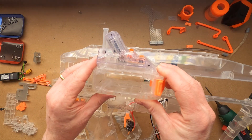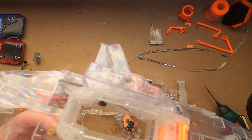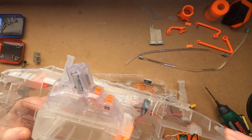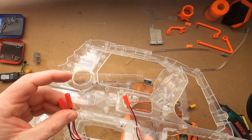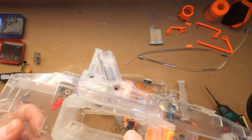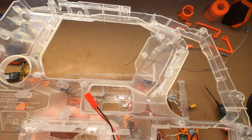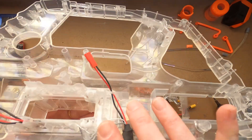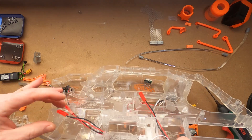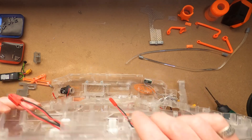There are three pairs of wires that I've routed inside the shell. Two go to the dart detector front barrel section, and the third is to power the unit. The wires that power the unit go to a buck converter first — this is a set 3 volt one inside a bit of heat shrink glued into place. The reason I used these JST connectors was exactly for this purpose, so that I could take the shell apart without having wires connected all over the place.